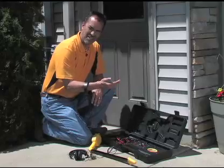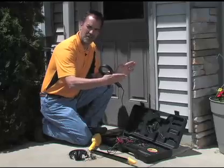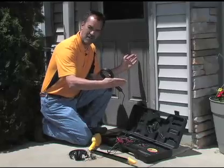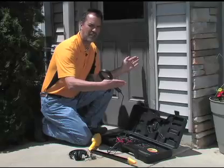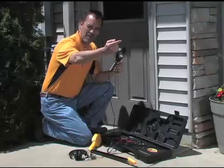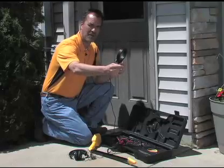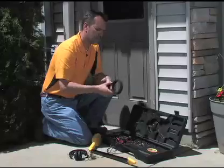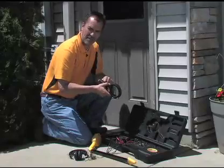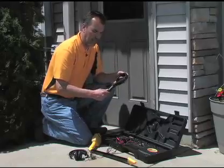Number two: for that to work, the clamp has to be placed between those two grounds. If you place it on the outside of one of those grounds, you do not have a circuit available to create that current. Additionally, as the signal travels down the cable and reaches the grounded point, that's where the signal stops — it doesn't go any farther. So the clamp is a very handy, easy-to-use piece; you just have a few parameters to keep in mind.